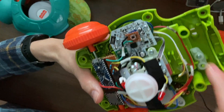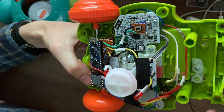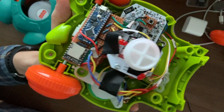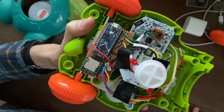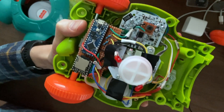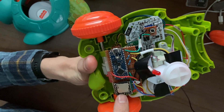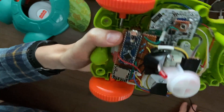You see how we're double-throwing two different things — where the speaker is connected and where the battery is connected — because I'm sharing these batteries with the Arduino as well. Originally I thought I don't need to tap into the battery source here. It's three double-A batteries, 4.5 volts — I was like, I can just use a 9-volt battery. Well it turns out the 9-volt battery doesn't provide enough current. If it's a brand new fresh 9-volt it works, but after just a few minutes the current drops down to a point where it doesn't supply enough to run both the Arduino and the DFPlayer Mini chip.